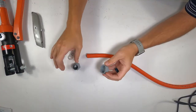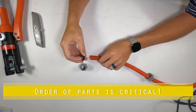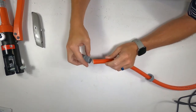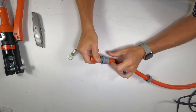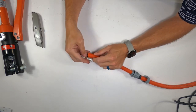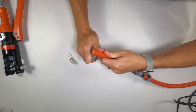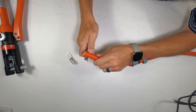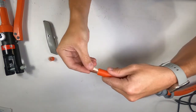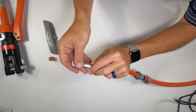To do this, we disassemble the cord grip — slide the cord grip top, the seal, and the body over the cable and slide them up and out of the way. Then measure your cut-back and remove just enough insulation, trying not to cut into the copper strands of your 2-aught cable. It should look like that, and then apply your 2-aught lug.